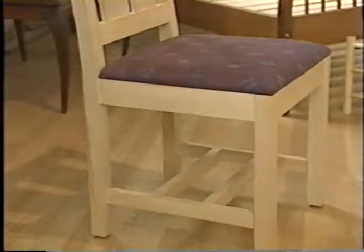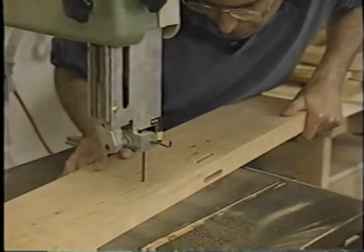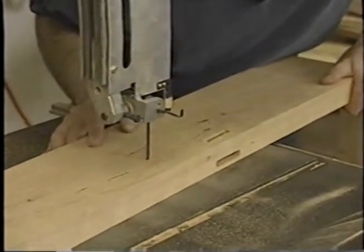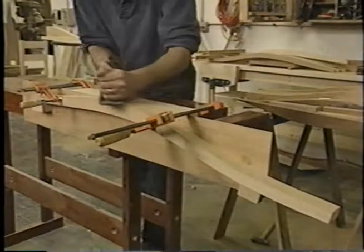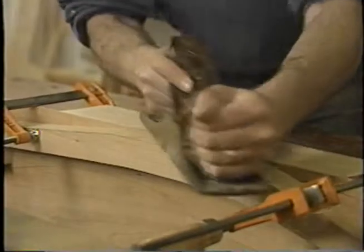The joinery on a back like this is really no more difficult than on the bent leg of my Craftsman chair. The joints are cut into the rectangular leg blanks before the curve is sawn in. Or, if necessary, you cut the shape first and then square up the flats that take the side rails. How do you figure out what the curve should be?